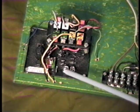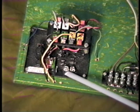There are two little potentiometers on the bottom of the eye control. The right one, marked with an S, is for sensitivity. You basically adjust it to make it as insensitive as possible while still having it trip when a train travels over it. Once it's set, you pretty much forget about it and don't need to adjust it anymore.